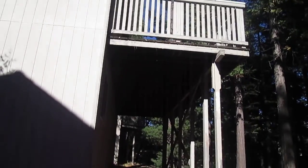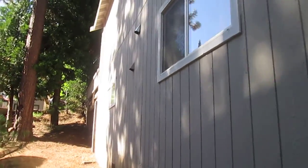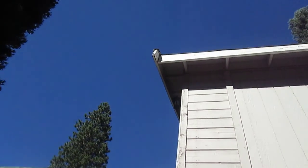That deck, I can't remember, but I think that deck needed to be stained as well. So like I said, we power wash them, we bleach them, we get them as nice as we can, then we use the oil-based stain on them, and usually that oil-based stain will get you anywhere between 4 and 10 years. So that's just what we do. And if you want us to leave it and you guys want to do it yourself, that's okay too. We are extremely busy, so we just offer while we're here, and we do a lot of them, and we know what we're doing.